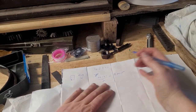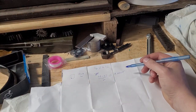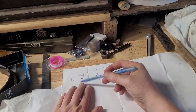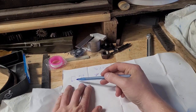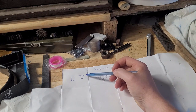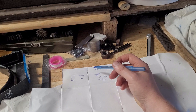So today we're going to be talking about grinding these blocks in closer to square. As of now, we have them within 6/10,000ths of an inch. An explanation of squareness is effectively over here we see how close to 90 degrees each of these corners are. Now, to some degree or another, everything is going to lean one way or lean another. It's always going to have a slight rhombic shape. There's no such thing as a perfect 90-degree corner.